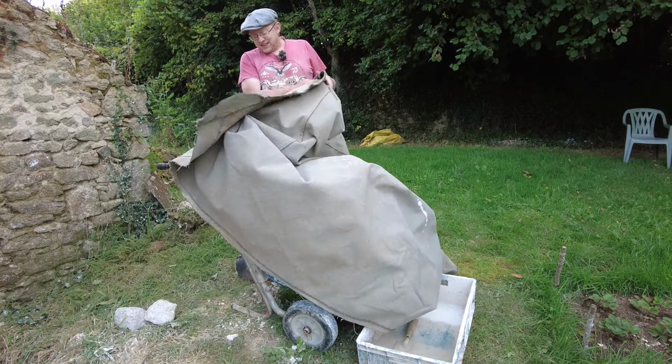I don't know if it shows, but it's come out a little bit more creamy grey than we really wanted. And I don't know if it's because it's probably high 20s, close to 30 degrees now, so it could be that the lime's been drawn to the surface or something like that, but I don't know. But I've got my stiff plastic brush and I'm going to start tapping back, and what that should hopefully do is push the mortar into any air gaps and give the surface a bit of a smoother texture, and should reveal the stones a little bit more.